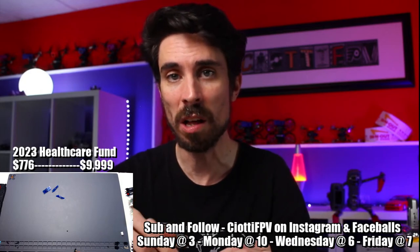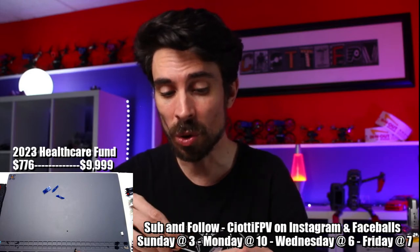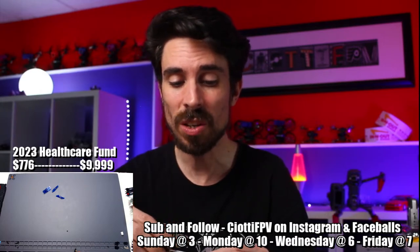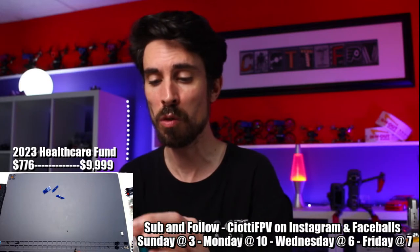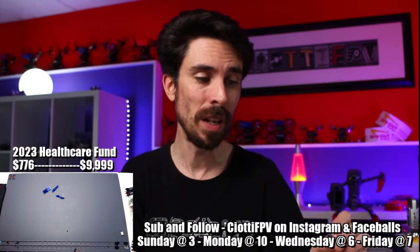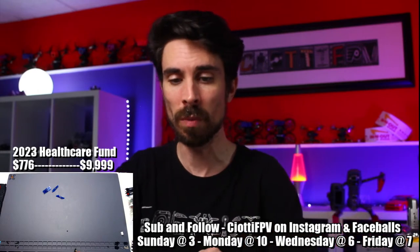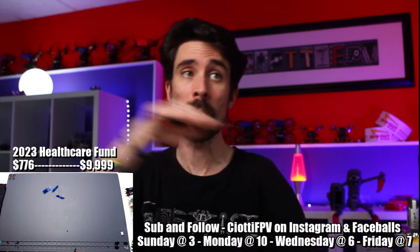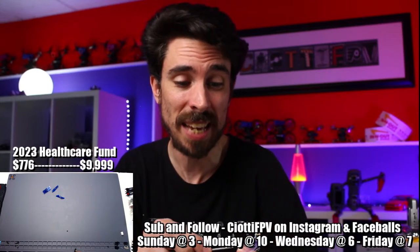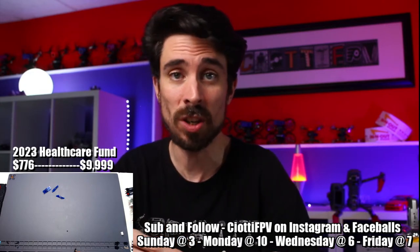There's not a whole hell of a lot, if anything, that you can do to the tune to make it fly better indoors. Technically you can play around with throttle expo to help with the throttle control indoors, but throttle control is probably not going to be the primary issue. The issue you're going to be running into is bouncing sideways into stuff. And there's just nothing in the PID tune that has anything to do with that. That is just an engineering problem, right?